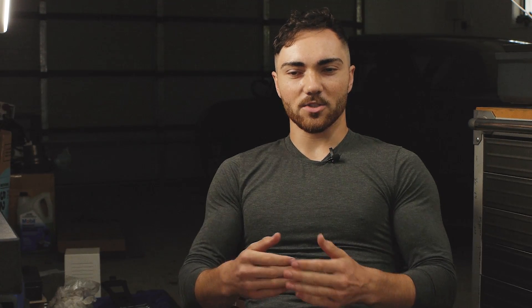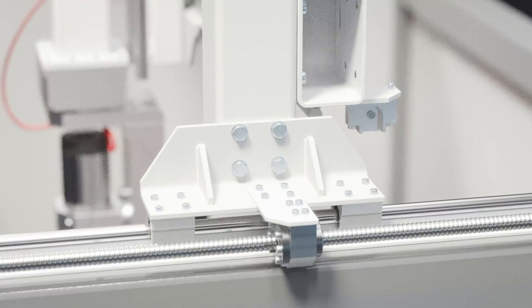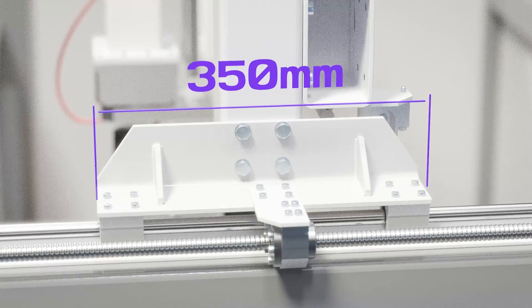Next, this was a fault of my design — I was working with a tight budget and trying to squeeze as much envelope as possible out of a certain length of ball screw, linear guide, and frame size. I ended up making the bearings on the gantry too close together, which results in a lot of lever action on those bearings. They should have been spaced maybe 50% further apart. I generally use a four-to-one rule: if the bearings are 200 millimeters apart, the maximum the tool should be working from is four times 200, which is 800 millimeters away. Any more than that and rigidity is lacking. Putting too much stress through your bearings will cause them to wear out quicker.